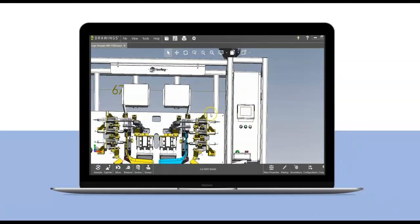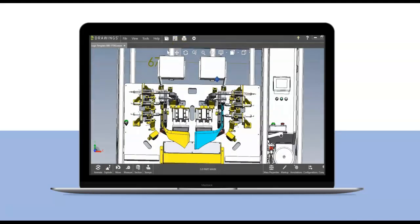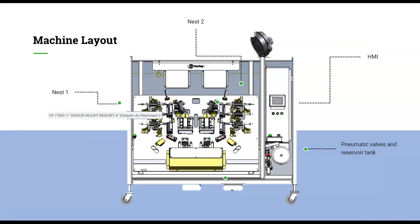So let's go ahead and get started and begin to scope this project out. One of the first things we want to do is understand the layout. What I like to do when doing this is I like to group components together — the HMI and all of our physical switches. I also noticed that there were a stop button, two palm buttons, and light curtains on this machine. I like to group those pieces together because there's just only a few of them. I would consider putting those in my embedded IO. If I have a limited amount of embedded IO, I'd put those items there — seems like I would have adequate space.